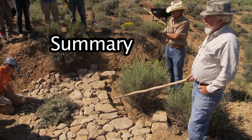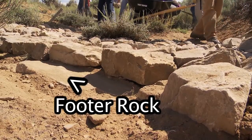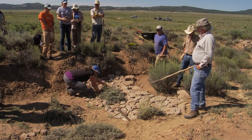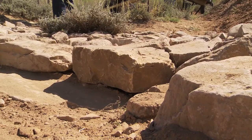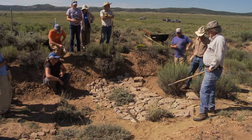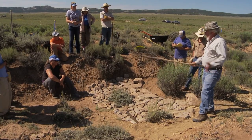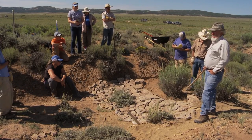When we built this one, we first cut a trench and installed the footer rocks — that's key. Then we laid the first row of rocks so it overlaps the footer rocks so that the water will splash onto the footers and not dig a scour hole. Then we tried to keep the surface relatively level as we work upstream. The most important thing to watch out for is having a large rock right here in the middle, because that narrows the channel and forces the water to go around, increasing the erosive force on the downstream edge when it gets there.